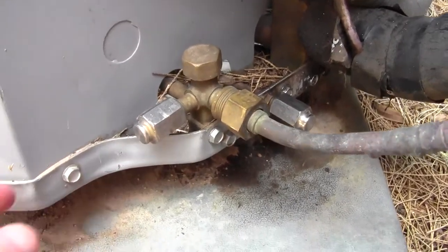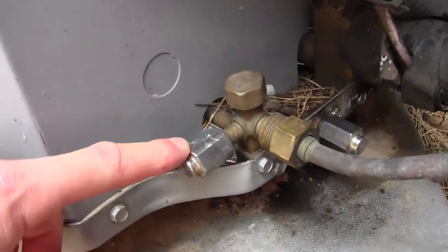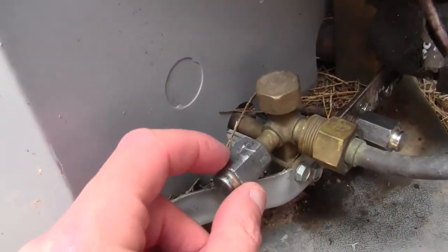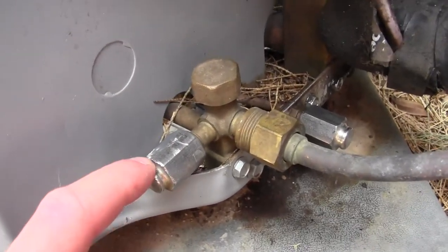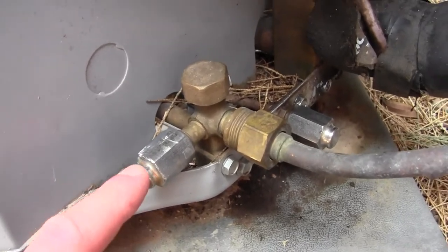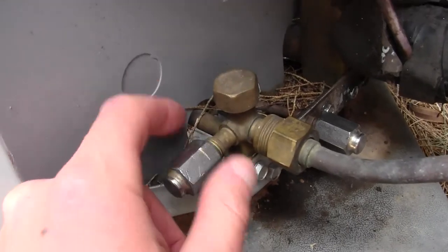My method: there's some granulated steel in this epoxy here. I put it in that slit and it was actually able to glue the inner threaded cylinder to the outer one, so now I can just unscrew it.